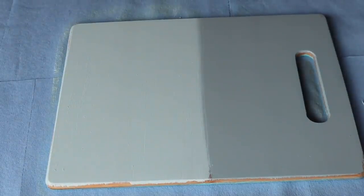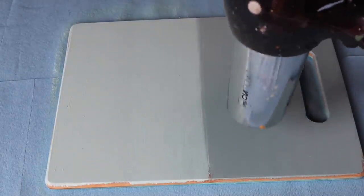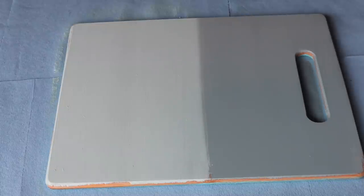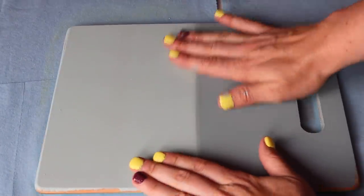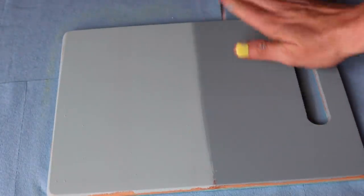I'm going to do two different colors side by side. People ask me all the time if you can blend mineral paint — you can, but it's totally different than a chalk style paint. I prefer chalk style paint for blending because it is so much easier. This is one coat, and I want to show you something important: when mineral paint dries, the colors darken. What's in the jar will be lighter than your final product, so please pick your colors from actual color cards that are painted and dried. That is one coat — almost a satin eggshell finish with minimal brush strokes.